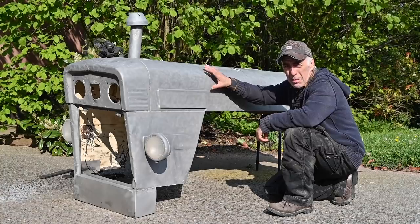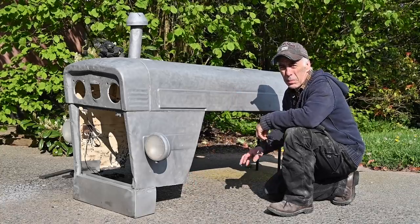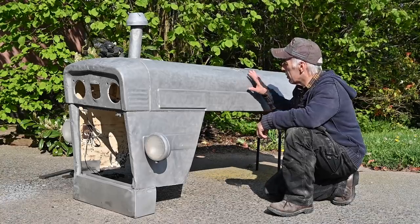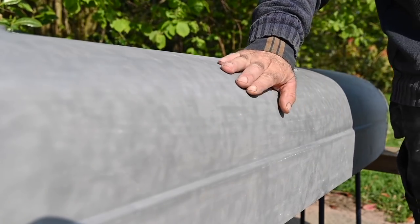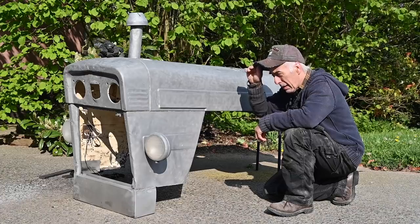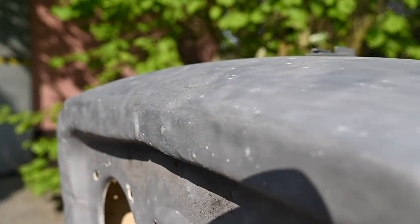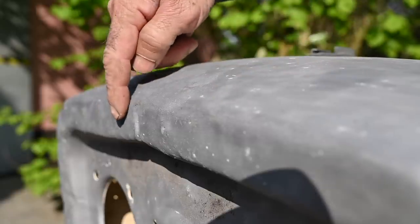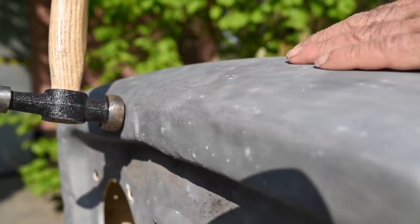Finally the bonnet is now bare metal. Now it's time to clean it up a bit further - I still have to take some dents out here and there, and then we're going to put some putty on to make it smoother in certain areas. I'm not going to make it showroom condition but I want to correct it where I can. That area is quite smooth - I don't need to sand it down again, I will still have to degrease it before putting the base coat on. It took me two hours and it was a pretty dirty job. There are a few more uneven areas and some parts sticking out that I'm going to smooth out with the hammer.